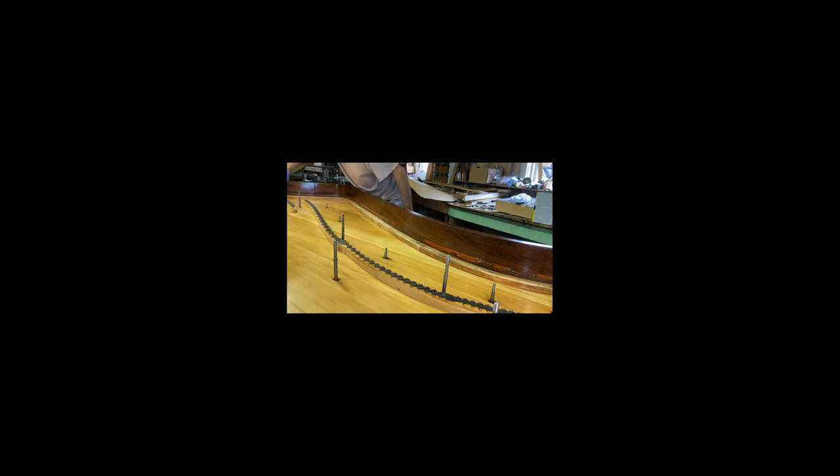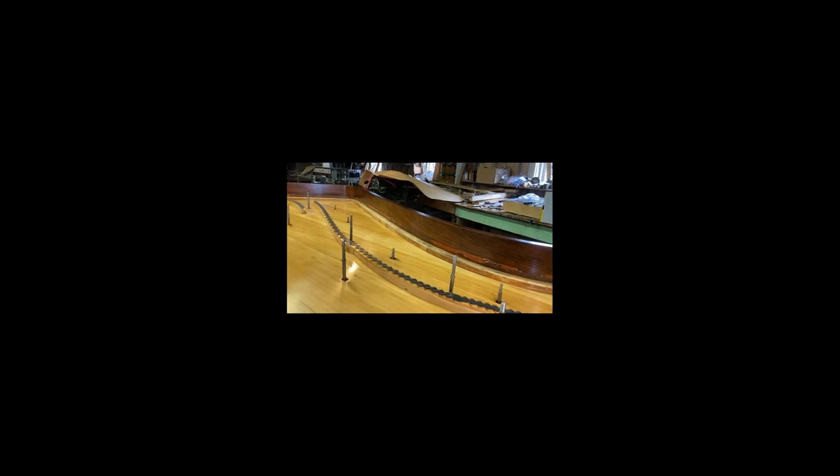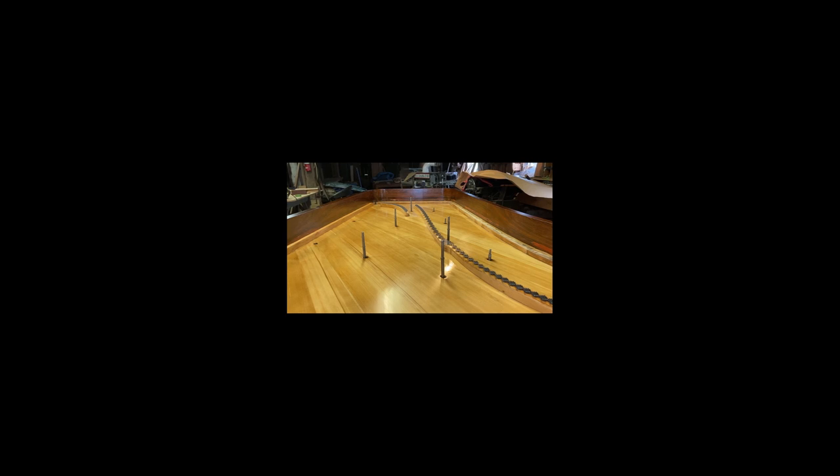Looks pretty good — all this is below the plate. These boo-boos here I'm going to have to hot knife to get them out. Too deep to melt with alcohol — you'd be washing away a lot of finish and we don't want to do that. So I'll take my hot knife and fix those boo-boos, especially that one way down at the end. Let this dry.